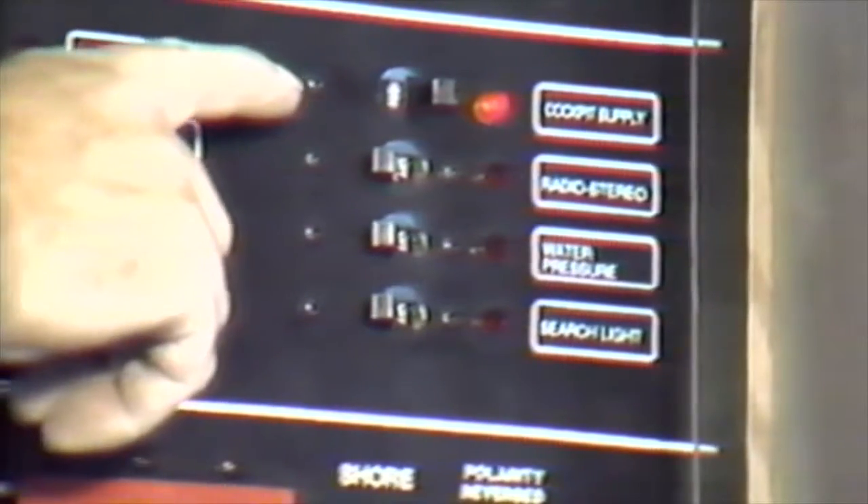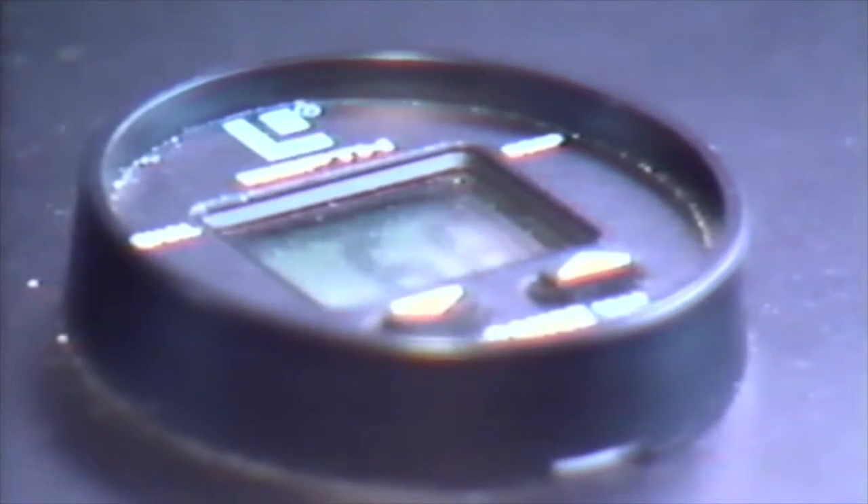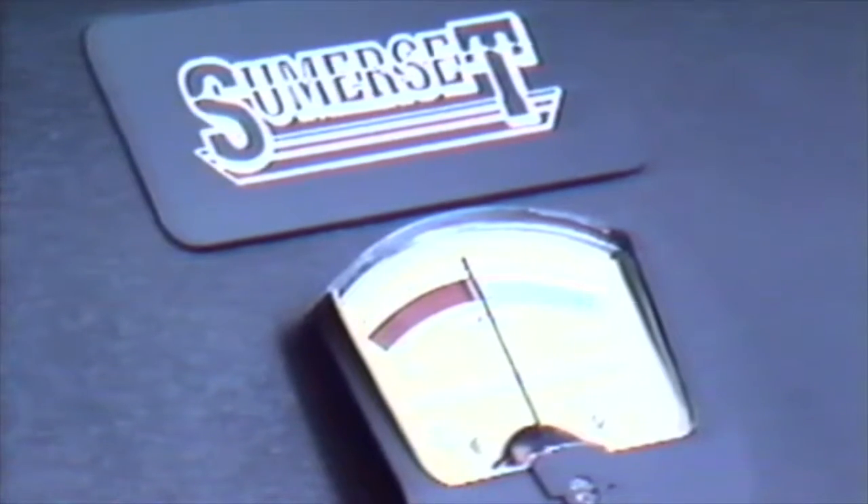If you are experiencing excessive wind, it is very helpful to have at least two persons to help bring the boat into its slip. We are now ready to begin our final preparations for leaving port. Make sure the engine hatches are down and secured for increased visibility. In the cockpit area, the operator begins to prepare for exiting the slip. Go to the master control panel and activate the 12-volt cockpit supply — this will give us rudder indication and use of the depth finder. As you begin to move, the rudder indicator should be about mid-ship. When you bring the shift levers to neutral, the flashing light becomes a steady light and you are ready for shifting and throttling.